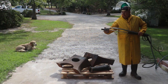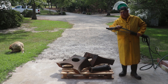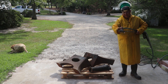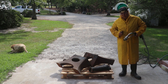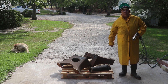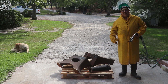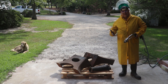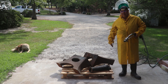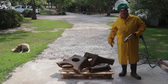A couple of other little things before we get started. You want to keep this hose pointed up on this piece here. If you let it get down underneath the bottom, you can actually have some water run back down the tube, which will clog things up — you need dry sand until it gets right to the mixing chamber. I just take some duct tape and tape my pipe back here, which tends to keep it in the up position and really helps keep that water out. Also, personal protective equipment: I've got rubber boots, a rain jacket, and a face shield — the face shield probably being the most important part. You are going to make a mess and have sand coming back at you. Because we're mixing this with water, we're encapsulating that silica dust in the water, which makes it a lot safer, but it's still a good idea to wear a dust mask to keep silica dust out of your lungs.